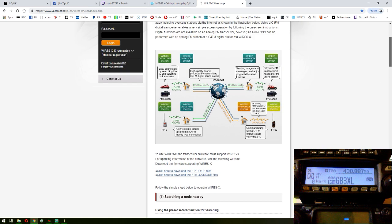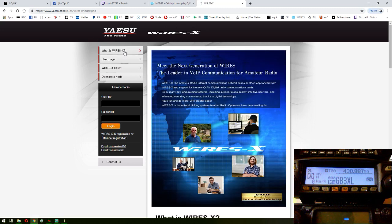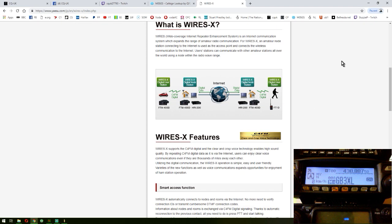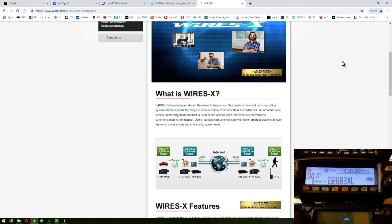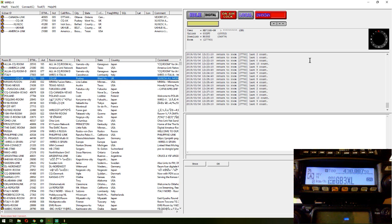So when you get those numbers back, then you can run the WIRES-X software. At the moment the radio is not in WIRES-X mode - it's not in what I call HRI mode. So once you've got the software and you've got your IDs from Yaesu, this site is very good. It'll tell you everything there is to know about WIRES-X and C4FM in general. Once you've done that and you've got your radio ID, your DTMF ID and your room ID back from Yaesu after you've registered, you can download the software from Yaesu.com for the HRI200.